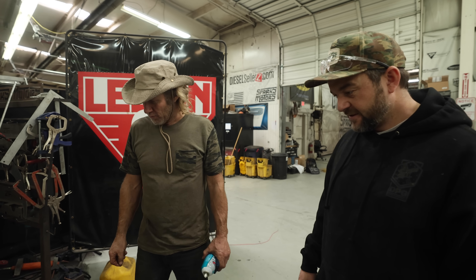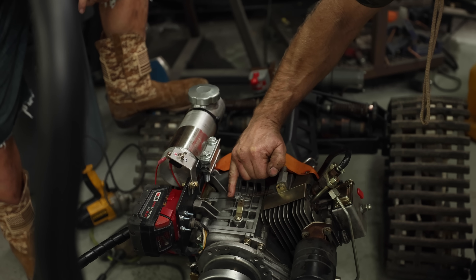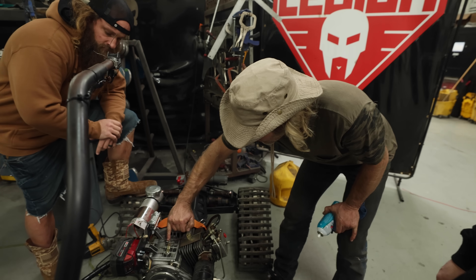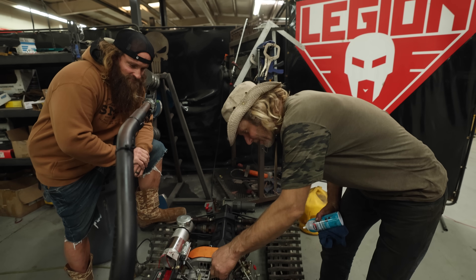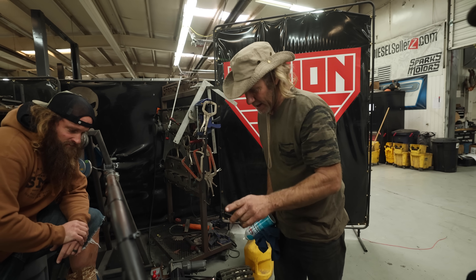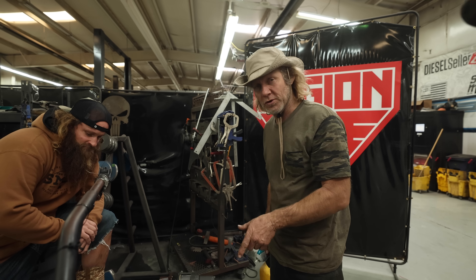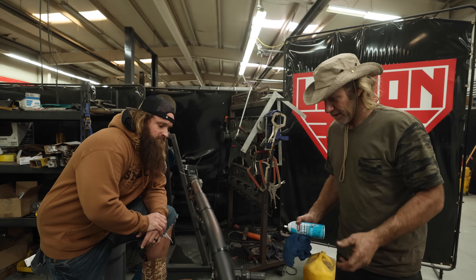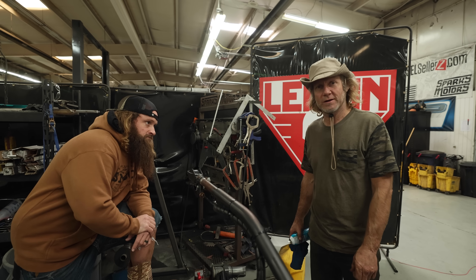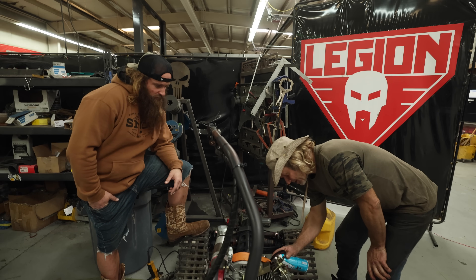What have you done today, Alan? Well, I built this new throttle linkage right here — I had to weld it onto the cable because the cable had broken its linkage. I made this by using a piece of welding rod and a nut, and then doing some heating it up on the anvil and pounding on it. So we got a good throttle linkage. I also had to put ATF in the injector pump again in order to get it to build up enough pressure for that bypass spring — took me a little while to figure out how that worked. My little 14 PSI pump on there, if it doesn't want to pump, it's not going to help it much.